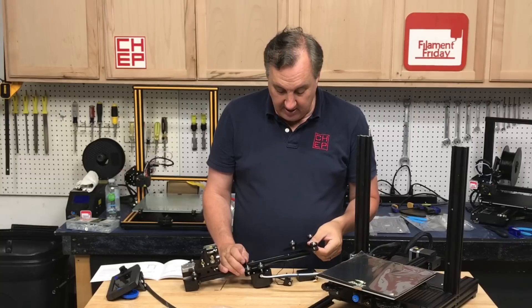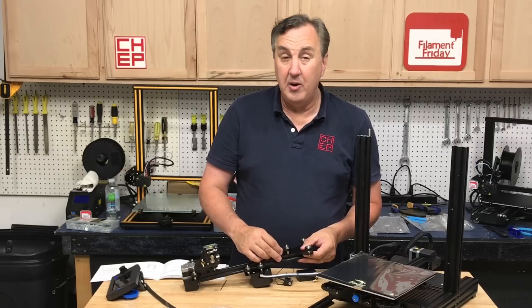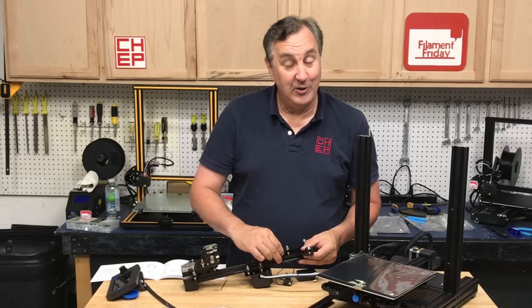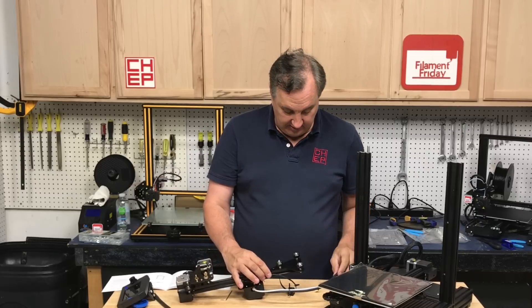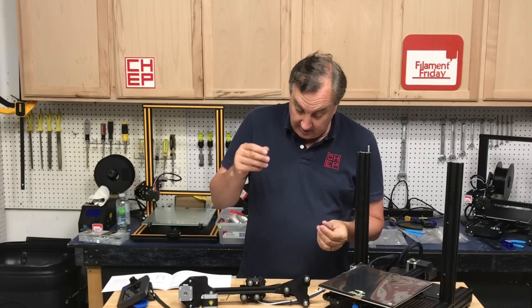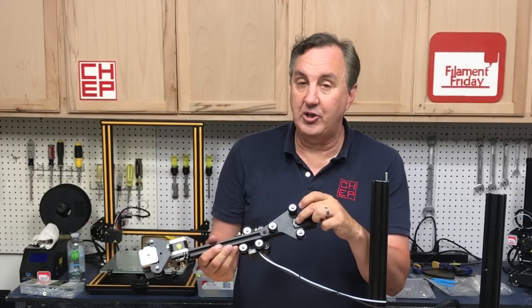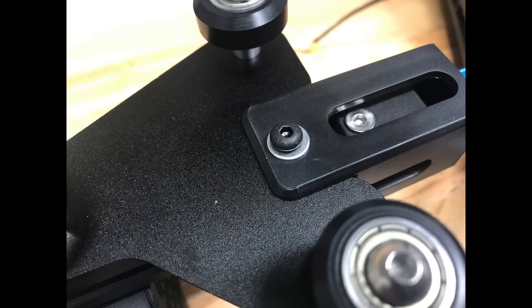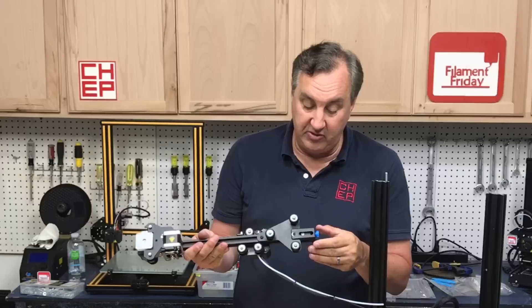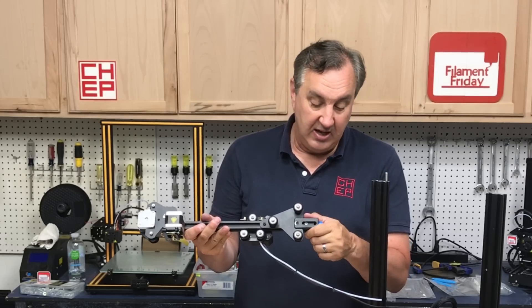The next step is to install the other bracket — two screws hold it in place right into the rail. Put the first one finger tight but don't put the second screw in yet. The assembly for the idler adjuster has screws on both sides: a countersunk screw on one side and a screw that goes through the bracket. These screws bump into each other and don't allow you to tighten it. My solution: put a one-millimeter thick washer on that screw so it can't tighten as far, and now the countersunk screw fits nicely. With that washer I'm able to tighten both screws and the adjuster is solid.